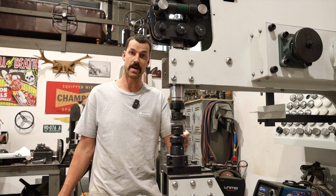Again, when you're knocking the weld off, if you're doing it this way, you don't want to get too much of this material. So you're not going to try and grind this dead flat and get rid of the weld entirely, because you're going to be removing a lot of material that you don't want to remove. You just are trying to knock just the top of the weld off if you can in certain areas. And then we can just start to hammer and dolly. I'm just using a standard flat face round hammer wherever my dolly is.